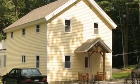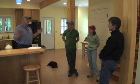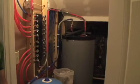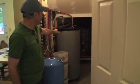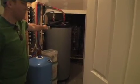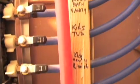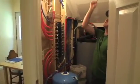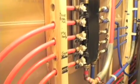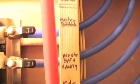We also figured out what the size of the building could be within our budget. We had very limited space, so the heating system is underneath the stairs. This is a superstore insulated hot water tank, and the house is heated with hot water through radiant tubing in the slab. We have this manifold here — Ellen and I ran the PEX tubing ourselves. A manifold system does save water because you don't spend as much time running water waiting for hot water; it comes a lot faster.